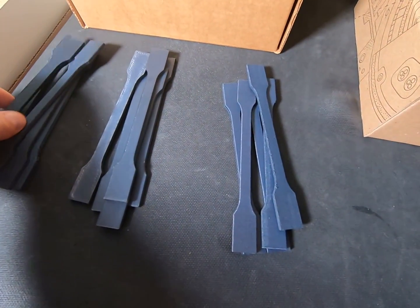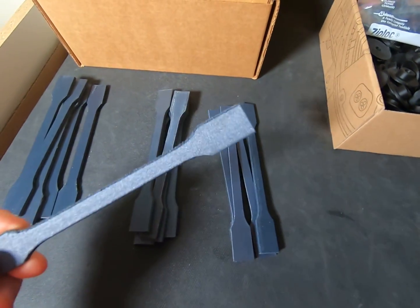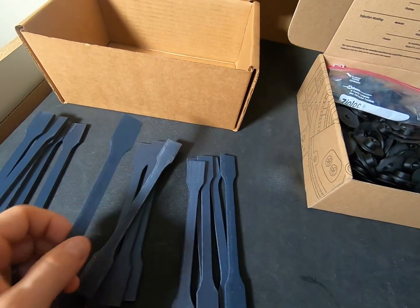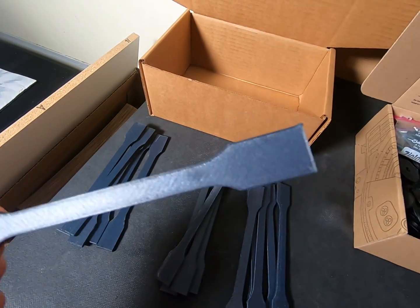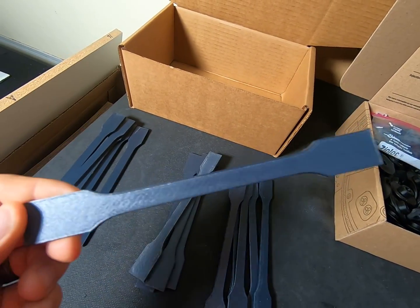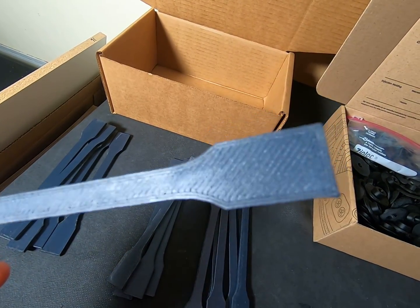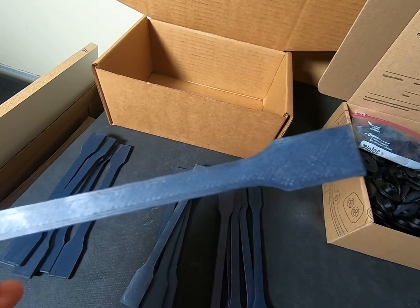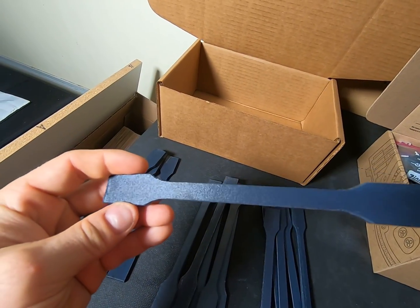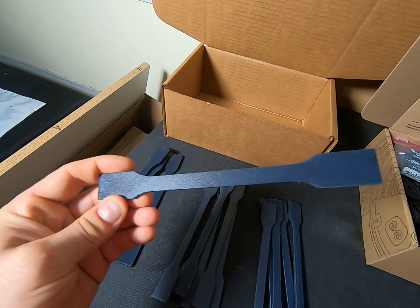We've got some parts here that were printed using the bake-and-scrape technique — some filament samples for a filament supplier: carbon fiber PEEK. These were printed standing tall with a really nice surface texture. These are the ones actually printed flat in the time-lapse — they look really nice. A little more outline overlap could probably help, but that fat first layer really gets the job done. Even if it doesn't look perfect, it works very well. These were printed sitting flat on the bed — carbon fiber PEEK from Solvay.